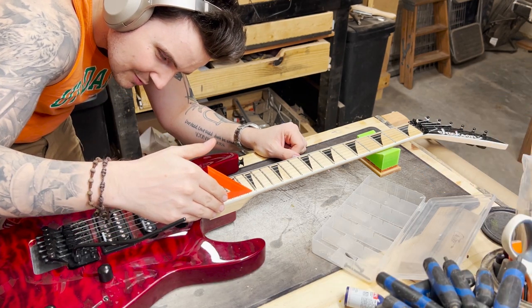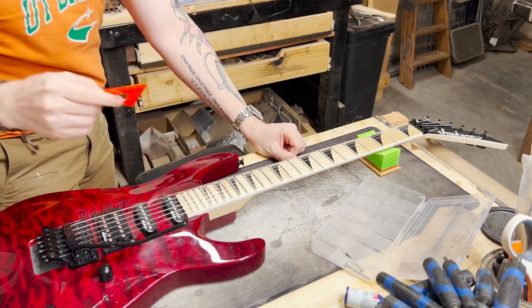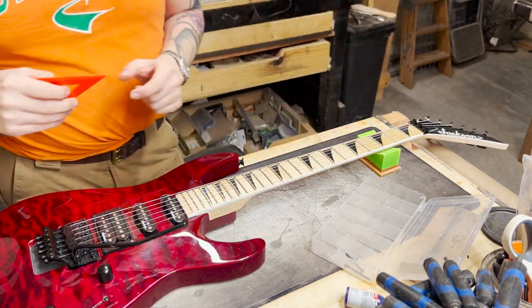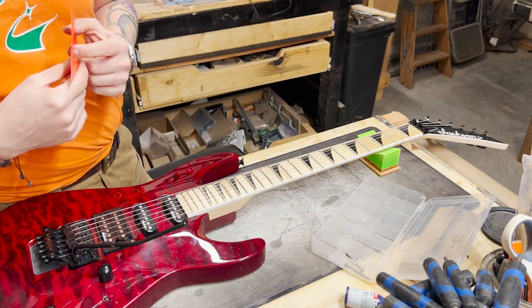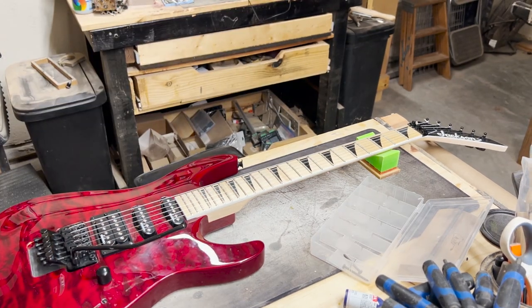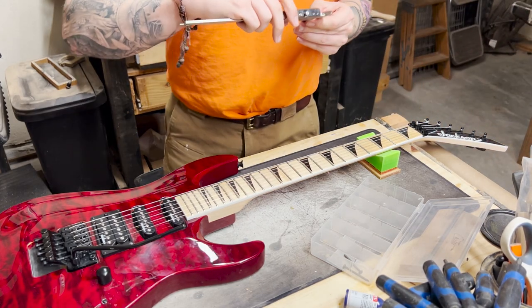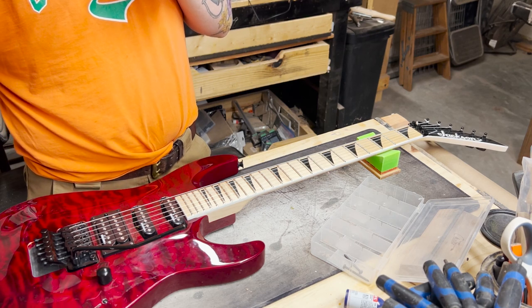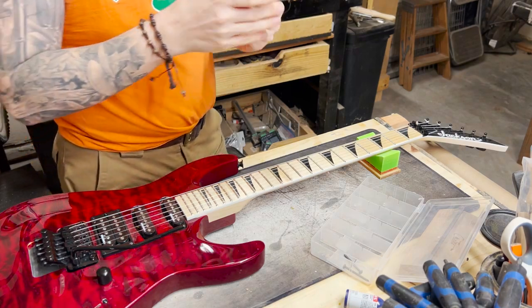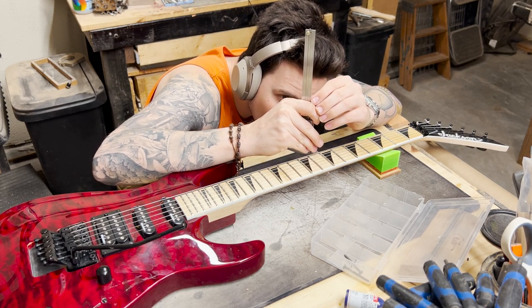And as I'm doing that, I'm realizing that this ruler starts at the edge, so it doesn't have the 1 millimeter gauge there. I could have sworn I had a ruler somewhere, but basically a straight rule. But I'm gonna do some quick math and figure out how much a 1/16 is in centimeters, and I'll go from there. So as it turns out, 1/16 of an inch is about 1.5 millimeters. It's 1.59, so it's actually closer to 1.6, but I am not that precise, at least not with my calipers here. So what I'm gonna do is basically check.